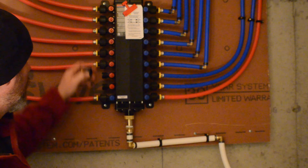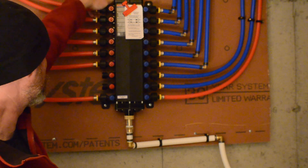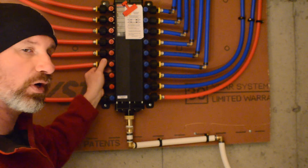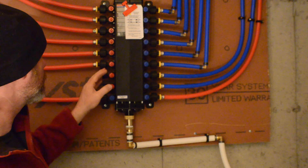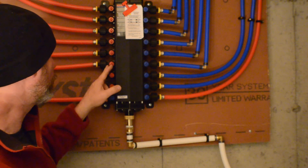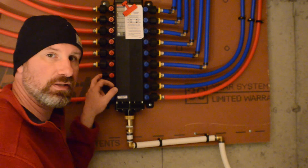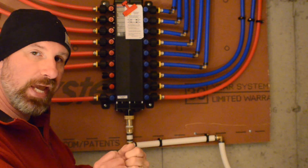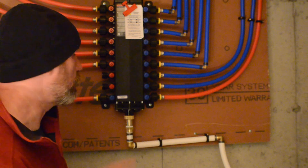As I was going through, you probably also saw that the tool did not fit in between these, so I had to take every other one off and just tighten those. These are all finger tight — there's a gasket inside here and that slides inside these tubes, and that makes the seal. So I'm just going to get these nice and tight. I'm going to go through and give them a quick little quarter turn on each just to make sure they're nice and tight. I don't want to over-tighten those because then you run the risk of breaking the threads. Sometimes if you've got a gasket and you over-tighten something, it's counterproductive — you think the tighter it is, the better seal you'll get, but it can actually start leaking. You can pinch those gaskets, break the threads, break the plastic female part. So again, not too tight.